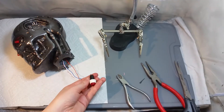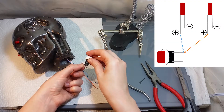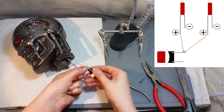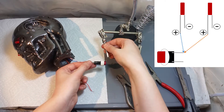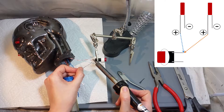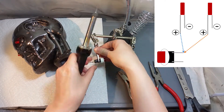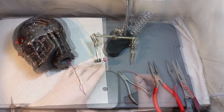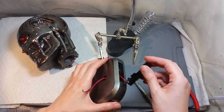I'm gonna twist the stripped tips and make them pass through the hole in one of the pins of the on-off button. After that I'm gonna do some final twists to attach the wires well to the pin and solder them together. I'll be showing a little diagram on screen to help you understand how I'm soldering all these wires. This base with helping hands is very useful and cheap, so I recommend it — I'll leave a link in the description. In the meantime you can go ahead and start inserting the battery holder into the base.